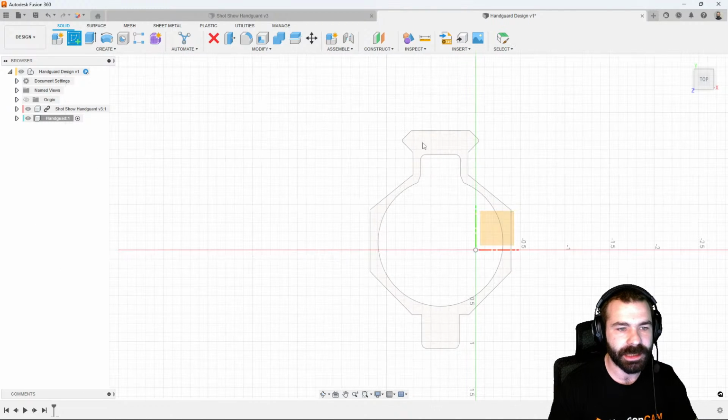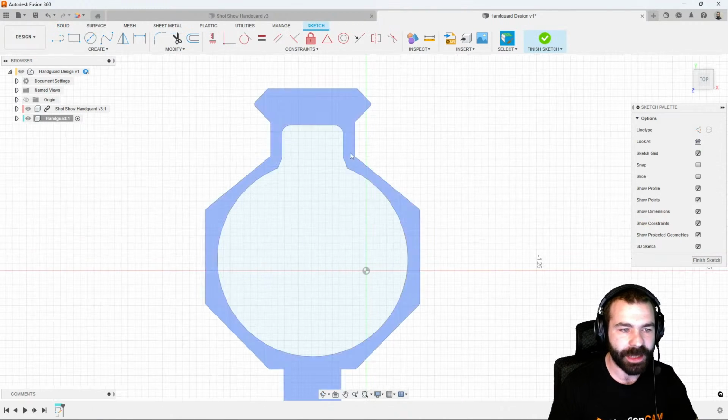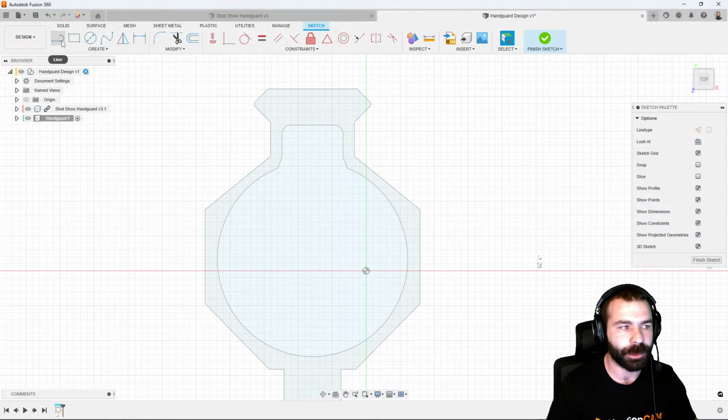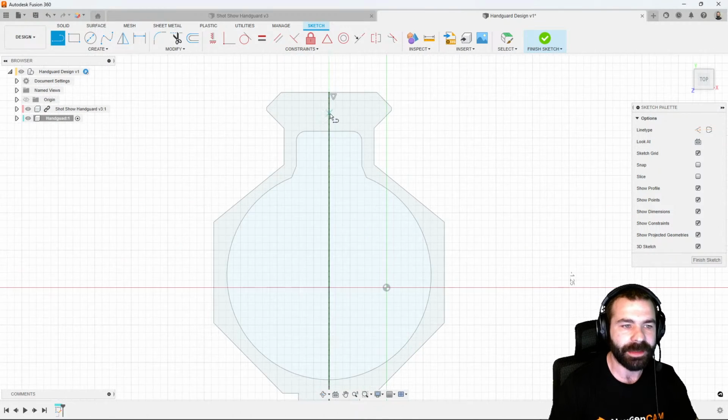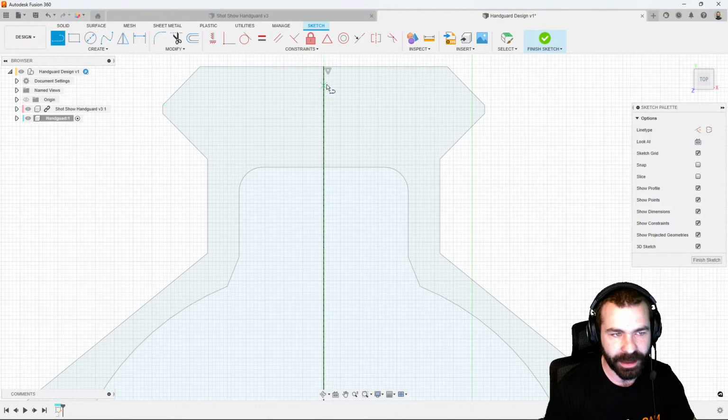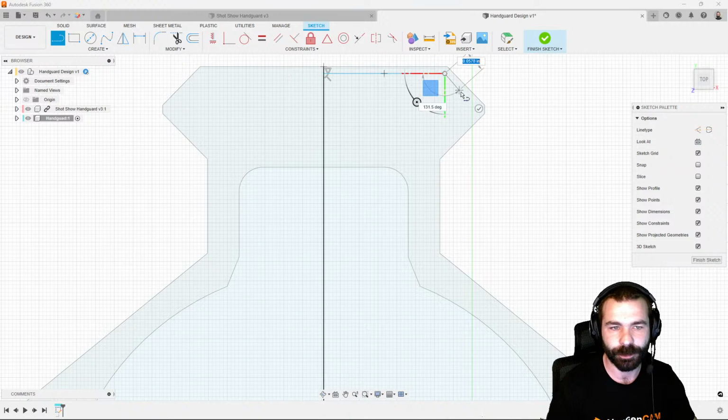So let's create our sketch on our face. And now we actually have an automatic projection of what to work with. And we can go through, and again, is 100% here, create your center line because we're going for symmetry, left and right. And then we could start to build out these profiles that we know are actually going to be undersized based on the real specs of whatever you pull online at the end of the day.